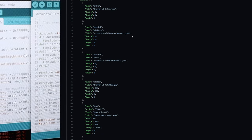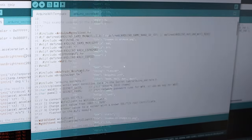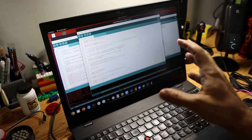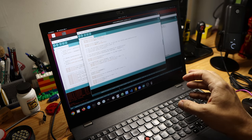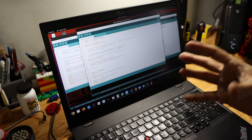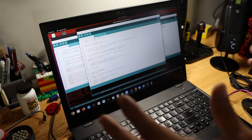All of these have libraries here. I did want to go over the terms for people who are curious. I will just blast whatever data I'm going to be sending to that server, and whoever's listening for it will be able to receive it. What that allows is that if I have multiple parts of the suit that need to subscribe and listen — say they're listening for what the gauntlet's doing, or what a boot is doing — they can subscribe to that and listen. I can have all of these interconnected devices working together.